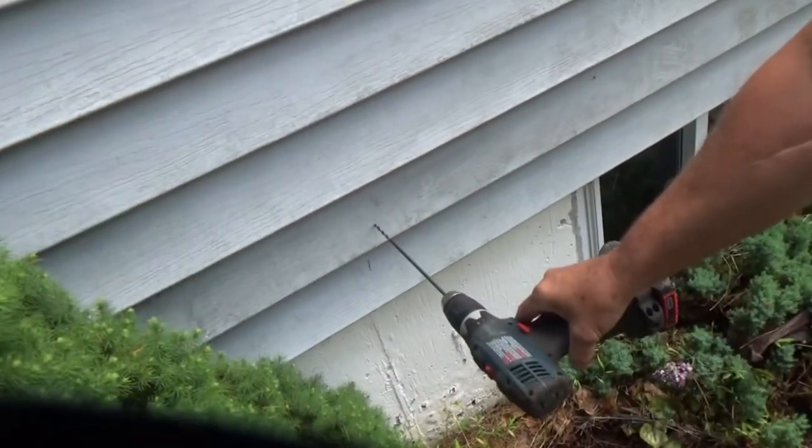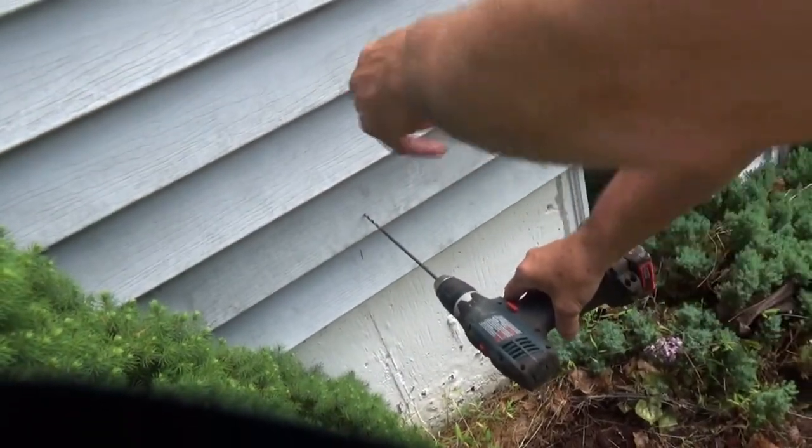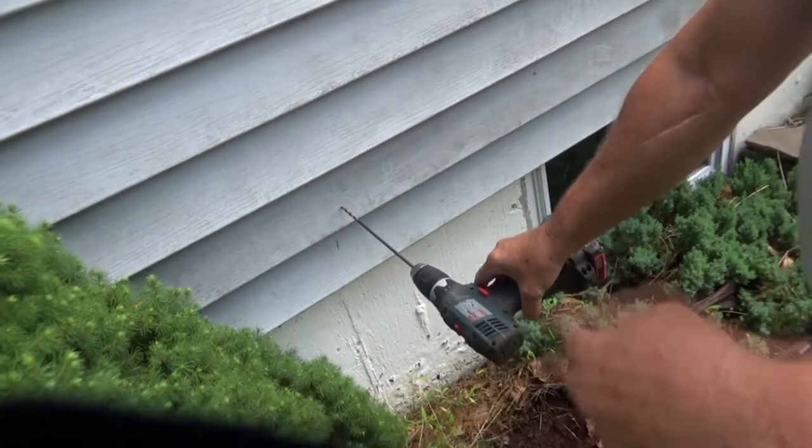Five and a half up and then I can go. I always drill up so the water — because the water shuts off inside the house — you want that to drain out of the hose bib.